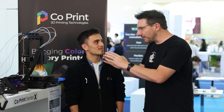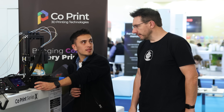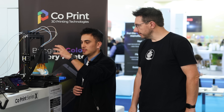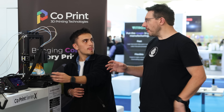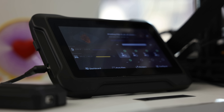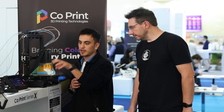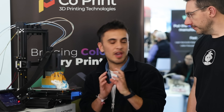Tell me about all the cool stuff you have right here. Here we have an Ender 3 V2, and the ChromaPad is the brain of the machine — it's replacing the original controller. It's very much not a stock machine. We change it a lot. It's basically run by ChromaPad, which is based on Klipper. We revised Klipper so it can have multi-extruder abilities and also keep up with speed.